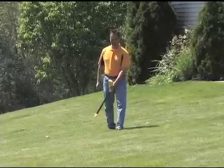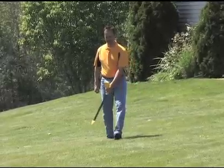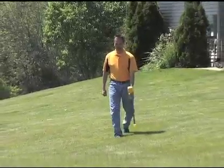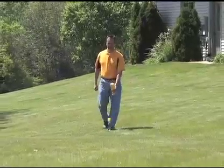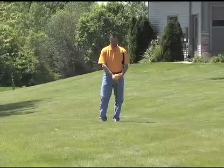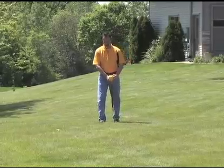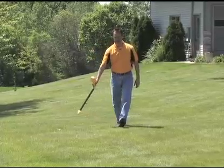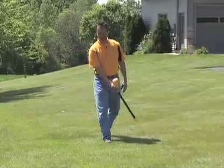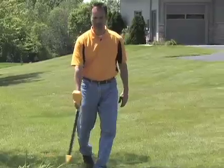Now I'm going to track it across the yard. Swing it far enough so you get good indication of signal on both sides — nice and steady. As long as you've got that null, you follow the signal. As I thought, I'm heading right towards that connection box. Now I'm going right to the connection box. If I had marker paint, I would paint that track and I'd have it right down to this box.